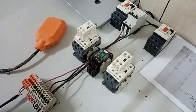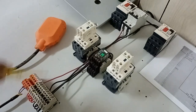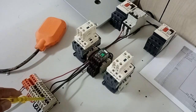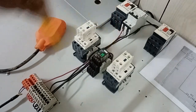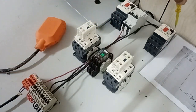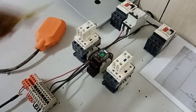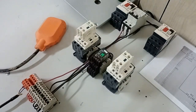For a faster wiring tutorial, I have already brought our line to our line terminal block and our neutral from the circuit breaker to our neutral terminal block. From our neutral, I already added a neutral line to our relay and to the two points of our overload relay normally closed contact. From this point it goes here, and then here.